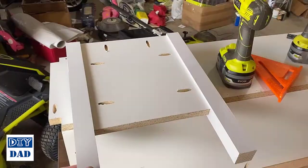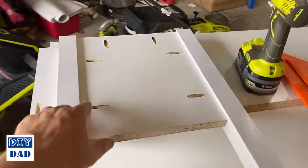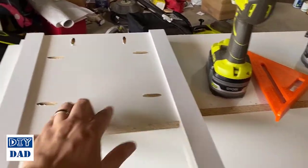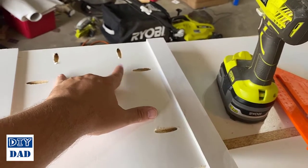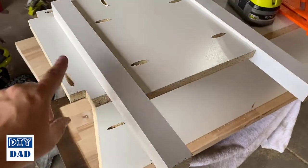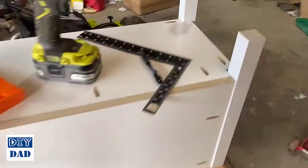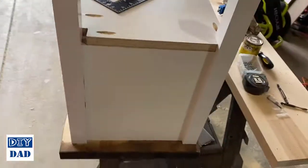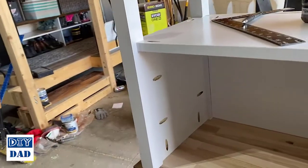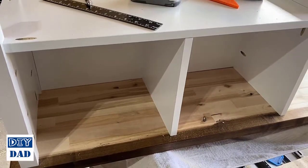We'll see. This is what the assembled leg assembly looks like. Essentially, I've got my end piece, and it's screwed into both sides of the leg. And then I have 2 holes here that will screw into the top. And then this assembly attaches with these 2 points, as well as this point and that point up there. So all attached, it looks like this. And all my screws and everything are hidden on the inside, where you won't really see them once this thing is in place and has all of its boxes and it is on its legs instead of being on its top.